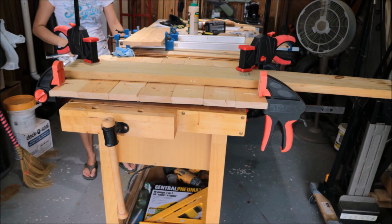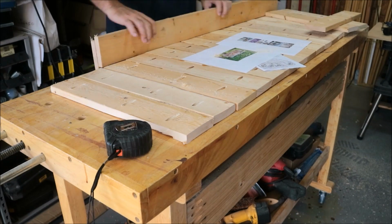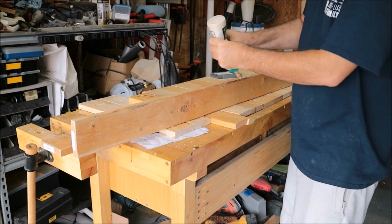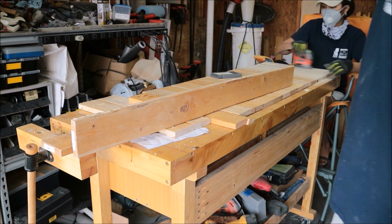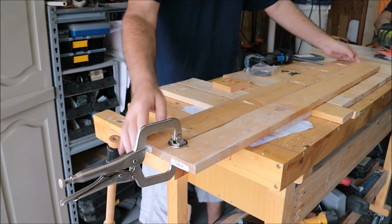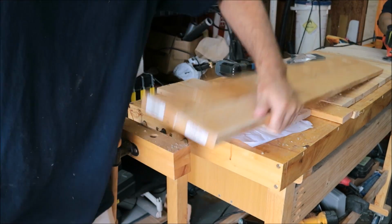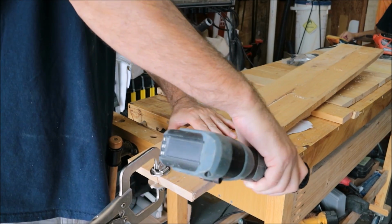We used lots of clamps to get this thing straight. It's mostly warped wood. At this point, all the base is assembled and more pocket hole screws to put the back on. It's time to glue the back together. I'm going to use a face clamp to put these together. It's much easier to use a face clamp when using pocket hole screws. Five screws should hold it together with no problem.